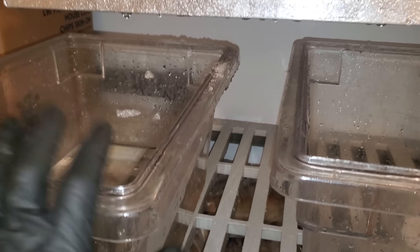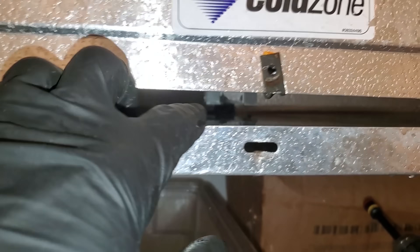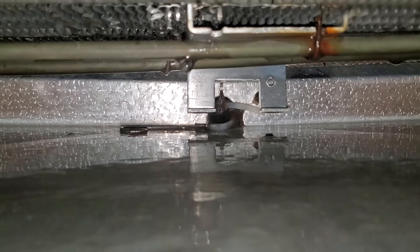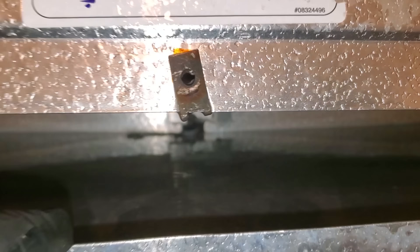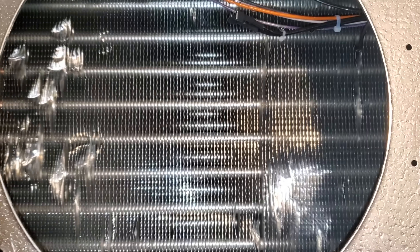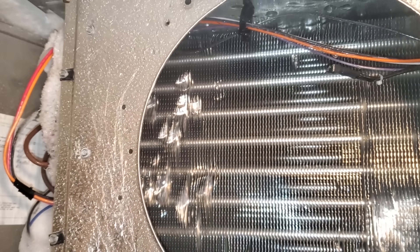It's just nice and cold in here right now. This drain is draining really slow, and I keep having to put these pans in here to catch a bunch of water, so I pulled it down just ever so slightly. The drain's plugged up right there with zip ties and stuff. Luckily it's right there, so I'm going to clear it out and hopefully this thing starts draining better. All that I do is just spray it from the front and take steam and let it keep going, and this will eventually happen.